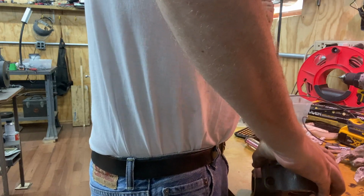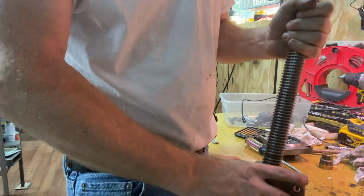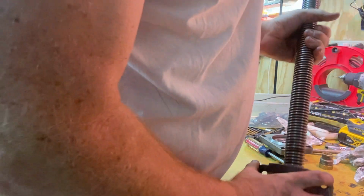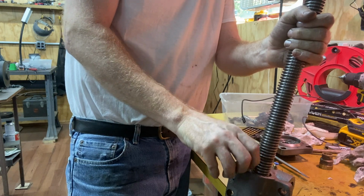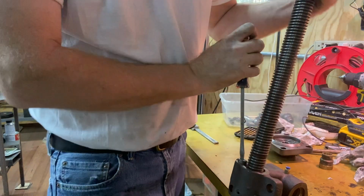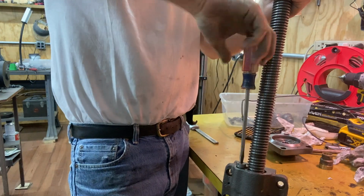They mated okay, but then when I go to put in this retaining screw, it wasn't countersunk. You see, it's supposed to be down below the level like that. And so I think that's correct. Although I suspect this is actually not going to be right either. Let's try. No, that's going to have that head sticking up too high. So I think I've got to advance that nut one more thread before putting it in there.